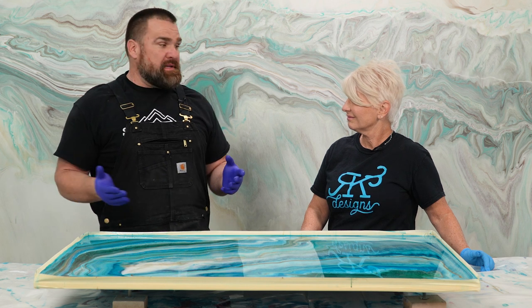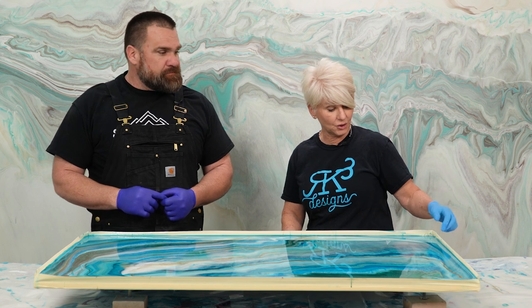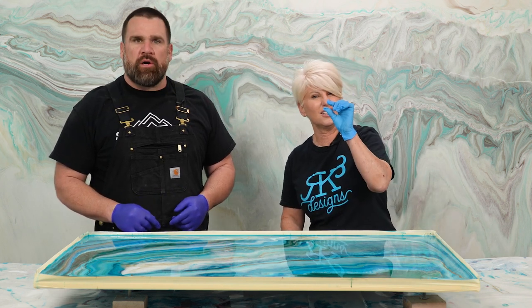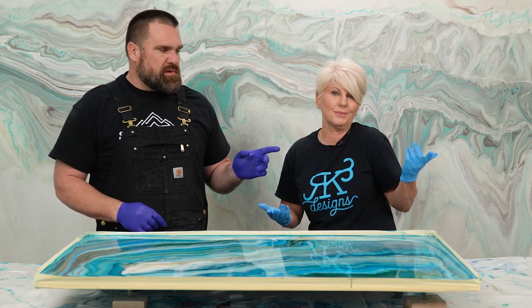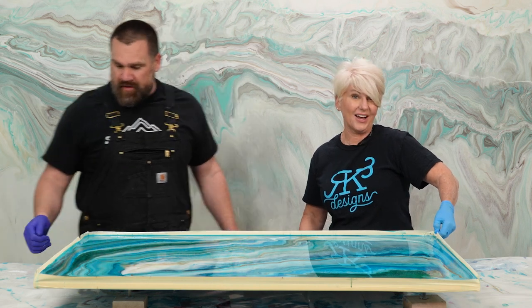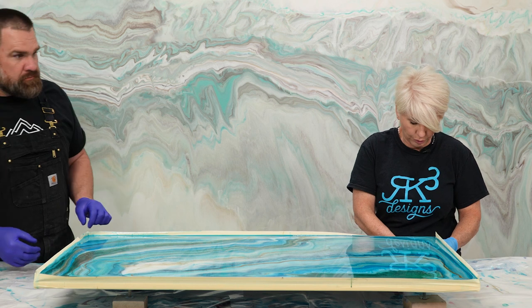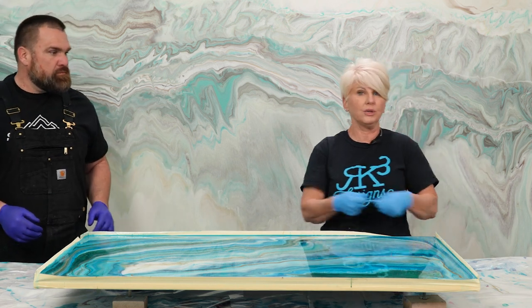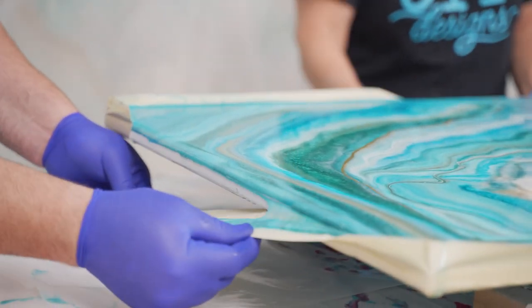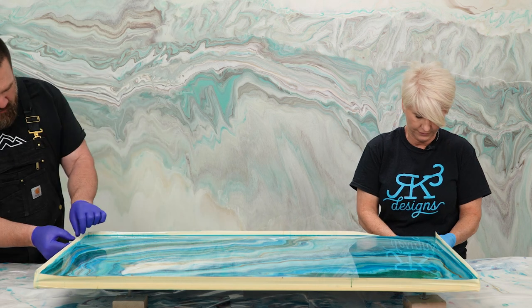And to begin pulling the tape, I kind of start in a corner. Is that how you do it? Yeah, that's fine. And what I actually do, sometimes I cheat, is I'll cut my tape just a little bit, and it just helps me get started. That's way smart, because I have totally fumbled around on that. So we're going to start pulling. Now, when you pull your tape, instead of just pulling it out, I like to pull it down, and that helps that epoxy start flowing over the edge. Yeah, you're almost telling it exactly where you want it to go.